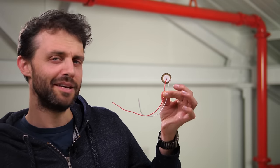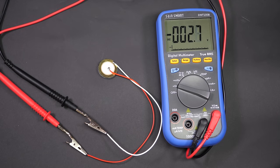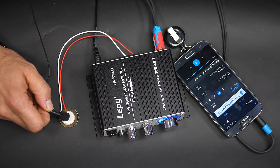The piezoelectric effect has a lot of uses besides just a high-voltage power source like in a barbecue lighter. It can also be used as a sensor. This is a piezoelectric disc — it's probably not quartz, it'll be something else. And if I press down on the disc, I can get a bit of a voltage across it. It's sensitive enough to be used as a pickup for sound, so I can actually use it as a microphone. It's not a great microphone, but it is a microphone. Interestingly, the piezoelectric effect is reversible — in a previous video I mentioned how speakers can be used as microphones and microphones as speakers. And it's true of this piezoelectric microphone: it can be used as a speaker. When you apply a voltage across a piezoelectric crystal, it will deform — it's the opposite of the piezoelectric effect.